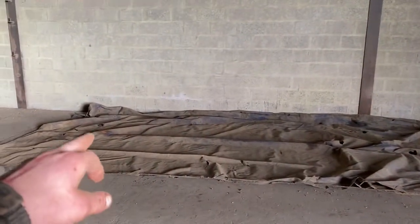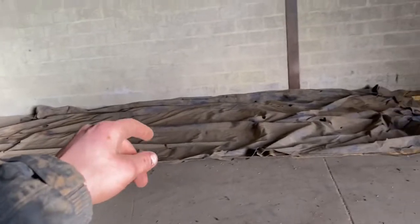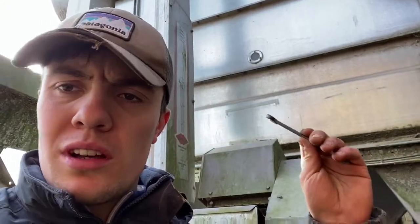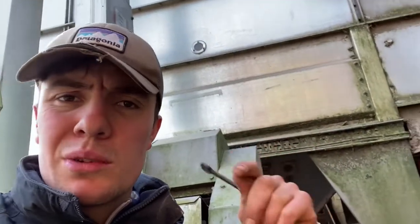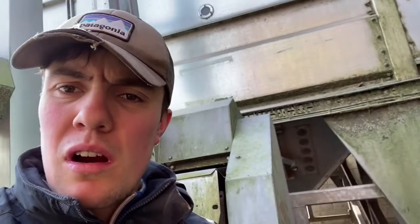That's where the pit for the dryer is. We just put metal sheets over the top of it and then tarpaulins as well, just to stop any dust and dirt getting in about it and causing bother at harvest time. Because we had the dryer going last week, we're just going to clean it out now and make sure there's no wheat left in it. There'll be wee pockets at the bottom of the elevators and whatnot, so we'll clean them out and make sure it's ready to go for harvest time.